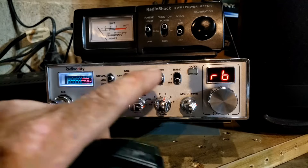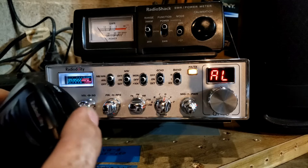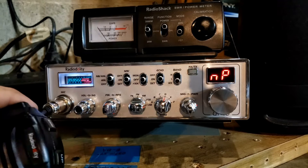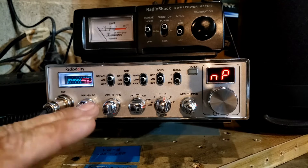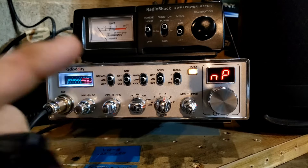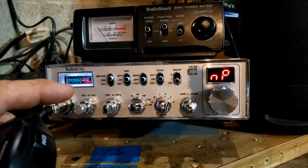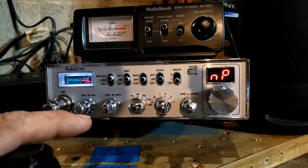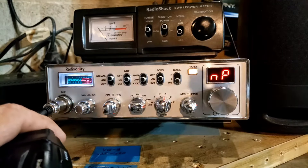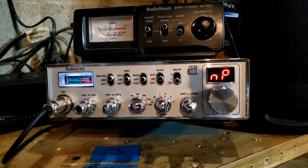As I said, the roger beep can be modified on this radio. There are a lot more things in the menu. This is one I really want to talk about — the NPC feature. All the shops will tell you to leave this feature off, that you'll have a square waveform and it'll sound bad on the air. Ignore them — if you talk only on AM, I 100% agree, do not turn it on. But if you talk on sideband, absolutely turn it on.